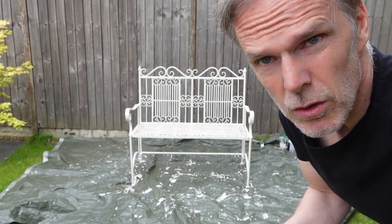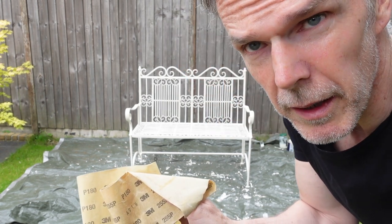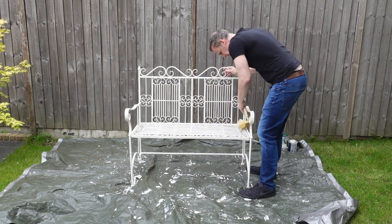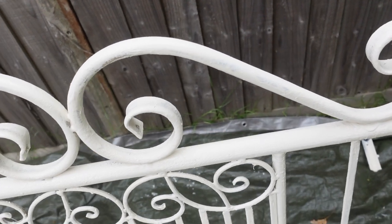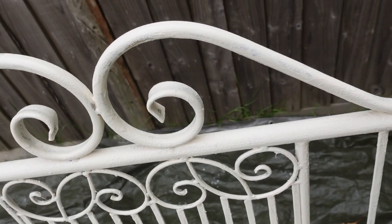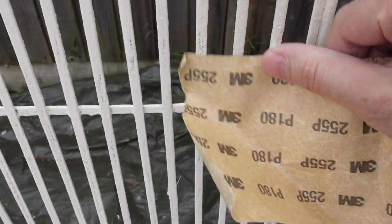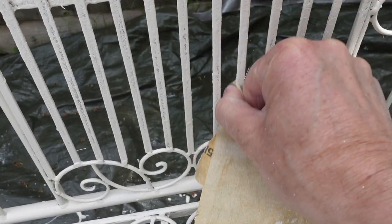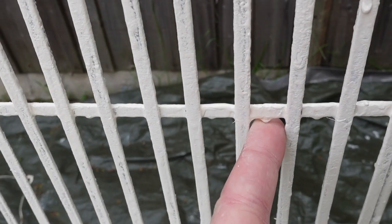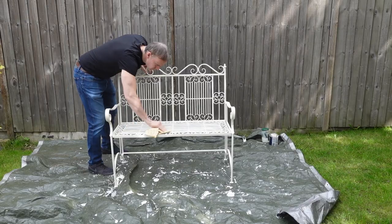Okay, it's now had two coats of Hammerite and now I'm going to sand it down with P180 grade paper. I'm using a smooth grade sandpaper just before I give this another light coat of paint, because you can see there are sections where you can still see through — I just need a little bit more paint on. So I'm going to give it a third and final coat. I'm sanding down any imperfections; you can see there's quite a few rough bits here. There's a slight drip here but that's sanded down okay. Now it's ready for the third and final coat.